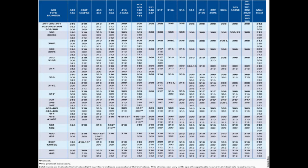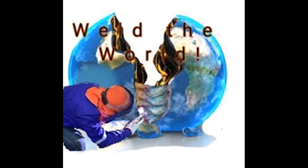Here's a chart — I can post up some of these charts if you want, but you guys have to leave me a comment and let me know. This is a chart for electrodes and base metals to help pick the right one. If you have two different base metals, this chart will help you find the correct electrode. For example: if my metal is 316 and I want to join it to 316L, I come across and find where they meet — a 316L and a 316, you should use an electrode for 316. Or if I'm going to join 316L to 316L, it says use 316L. Stay tuned for another part — weld the world.